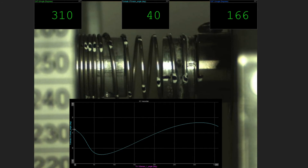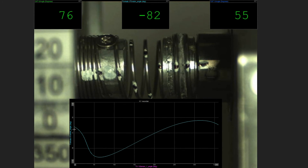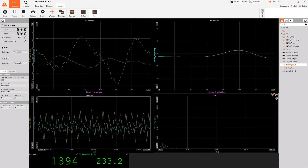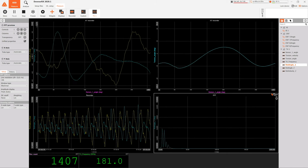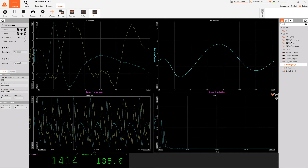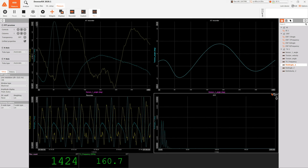Now we are ready to start measuring. We have two rotors rotating at the same speed. When we apply friction to one of the rotors, the rotor speed starts fluctuating, which creates torsional forces on the coupling between them. In the torsional vibrations predefined display, you can observe the rotational and torsional angles over each shaft rotation. Besides fluctuations of the RPMs over the time period, you can also see the FFT graph showing the rotational frequencies. If we release the brake that is causing the friction, we can see that the torsional angle is reduced.